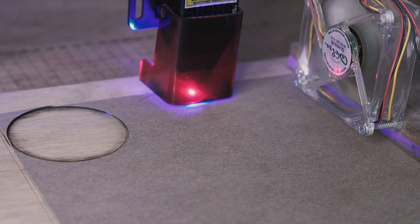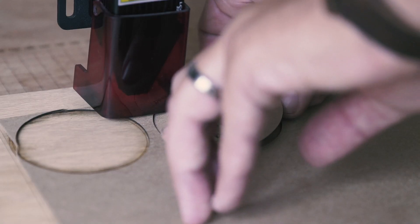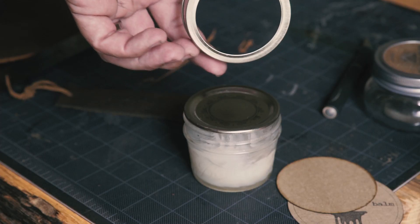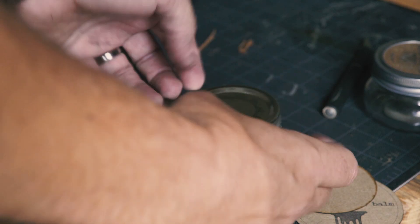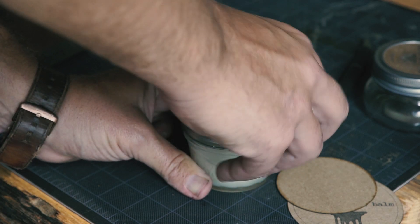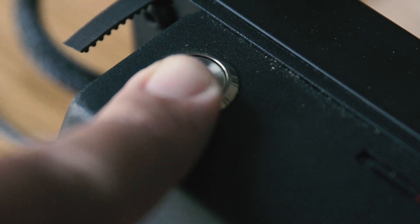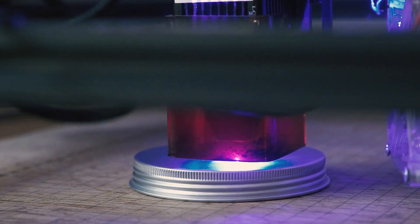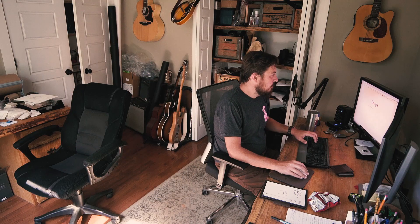A very practical application of this machine is making labels. I make my own food-safe wood finish for cutting boards and utensils and always like to keep my brand identity cohesive. I make these labels out of 30-point chipboard to fit under the ring of regular mouth canning jars. On this machine I can get a batch of 12 at a time from one sheet of chipboard relatively quickly, and once I have the file loaded, I can operate the process at the machine without a computer. I also tried engraving some graphics on aluminum, which did well, though I'll take time to dial in the design file and the speed and power settings.